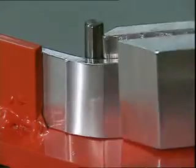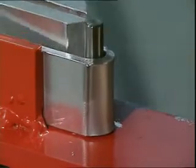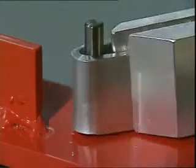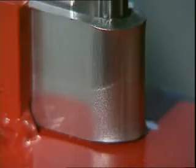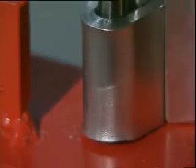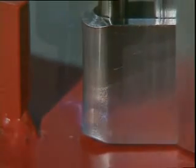How is the joint affected when bent around a tight radius? Here you can see that regardless of whether the test piece is bent with the weld joint on the outside or inside of the curve, the joint is equally strong. A certain degree of stretching can be seen beside the joint. This bending test also shows that full penetration has been achieved in the butt joint, which is free of fusion defects right through to the root.